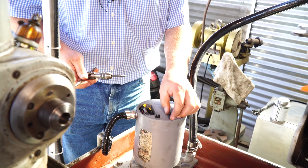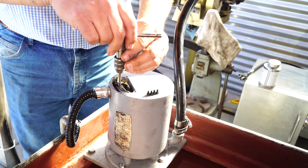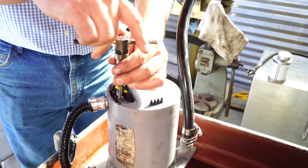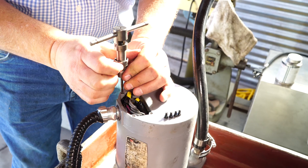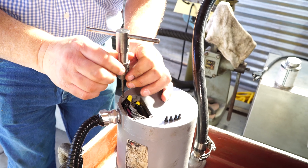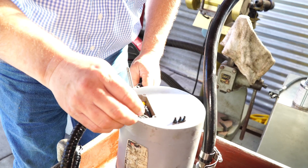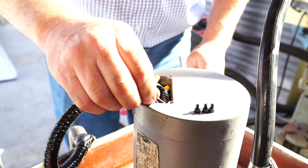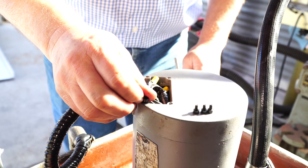There's not much left in getting this really buttoned up nicely, but there was no cap on here. Obviously the pump works — we've checked it. So I'm just going to come in here and chase these threads out; they're 8-32 threads. Nothing crazy, just super easy. It might need to be a little longer to hold our plate, depending on how thick it is.